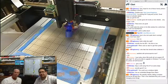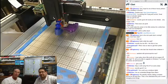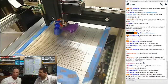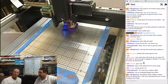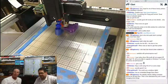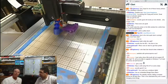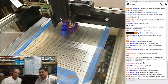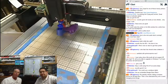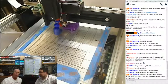Go to third world countries, if you're doing a 17-hour print, there's about a 50-50 chance you're going to lose electricity in the middle of that print. So we're looking at how to use short-term 2 to 4 hour UPSs that are affordable, you know, uninterruptible power sources that would allow the PC to check out while the print continues seamlessly, and then intelligent recovery so we can park at the end of a layer, come back, heat back up. There's a lot of really, what I think, essential algorithms and responses.